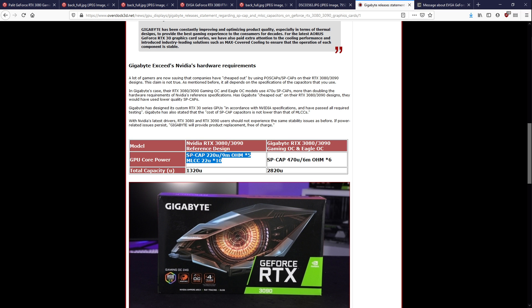As far as I know, most of the cards that were affected were specifically OC models — if you ran stock clocks it was fine. OC models were especially affected, basically regardless of what capacitor configuration they had. I've heard of TUF cards crashing, and those only use multi-layer ceramics. NVIDIA put out a driver update that fixes the instability, because evidently it's a combination of factors — something to do with the configuration of the driver and the workload.